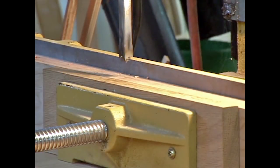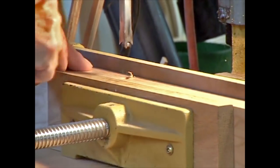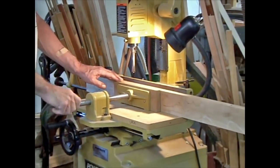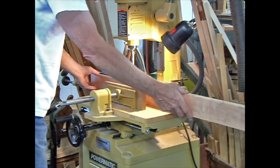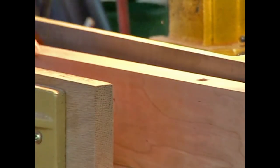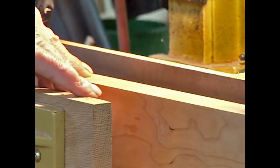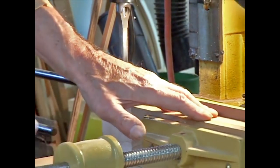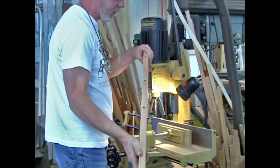Not very dramatic because it only goes down 3/16 of an inch. We can do the other end. The tricky part to doing these is getting it set exactly centered on the board. Basically, you bring the chisel down, rotate it by hand slightly, and then turn the board, do the same thing again. And when the two little holes line up, you know it's centered. So now we have the mortises that eventually will accept the ebony plugs.